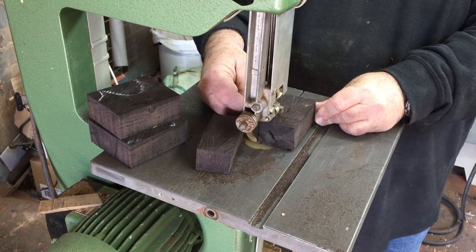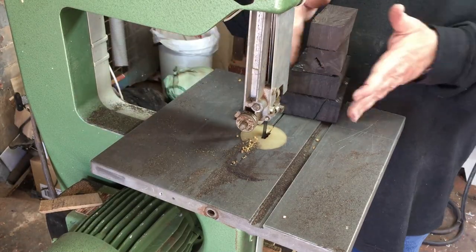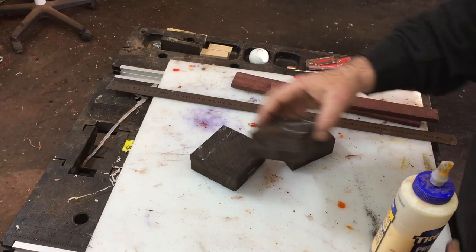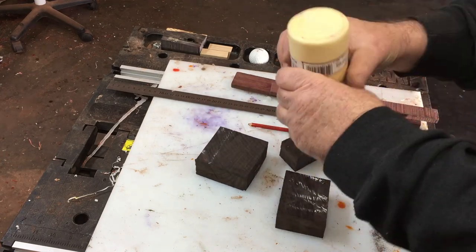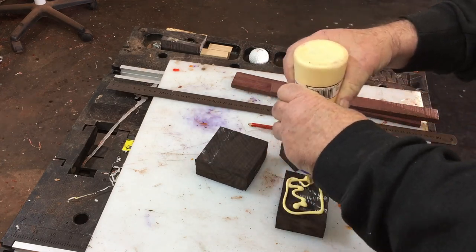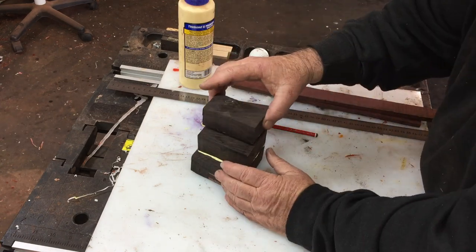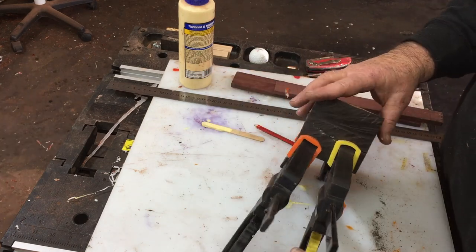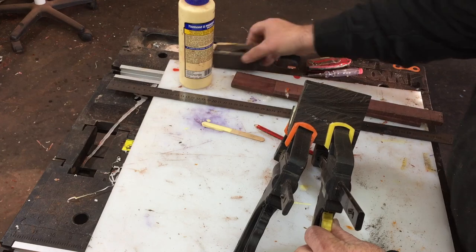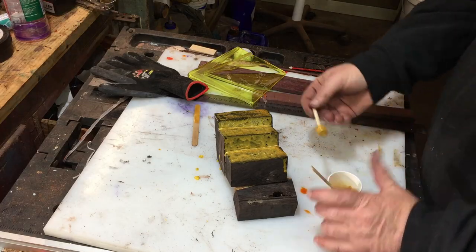African black wood is quite hard and it makes a lot of dust, like I said. And it's very difficult to mix it with resin. Because when you polish it in the end, it pushes out dust and it scratches the resin. I hope that on this one I'll manage to avoid it and come to a complete see-through resin. I hope so.